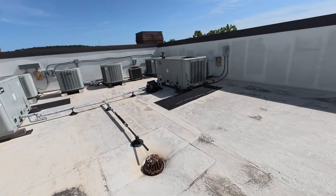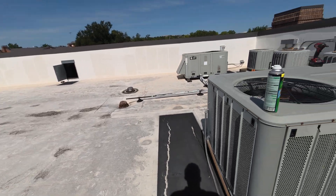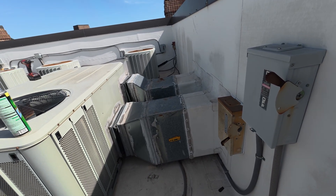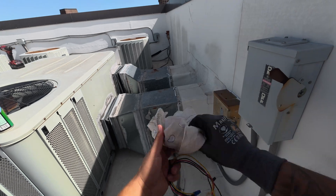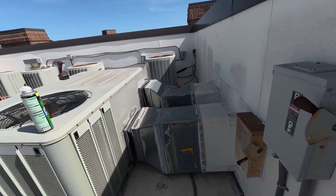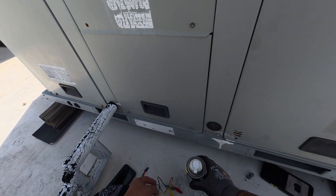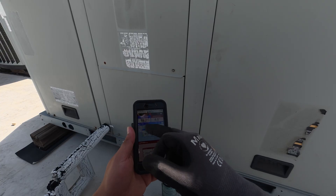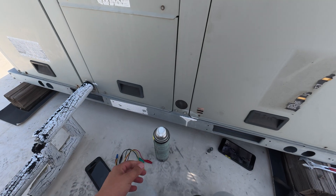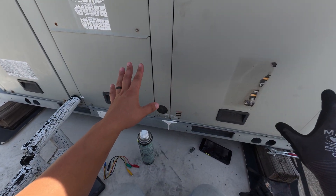One thing I've been trying to do is get a little more comfortable filming in public because I'm still a little shy. I've been taking my camera out to public places and just recording some stuff to try to get used to the environment. We're sitting at 65 degrees for a supply temp, which is a little high. We're sitting at a superheat of 19 — we need to drop that superheat down a little bit. We could probably top off the system with a little bit more refrigerant. I might need to go grab some refrigerant and my other gauges — let me go grab those really quick.